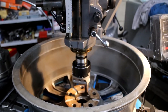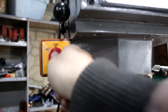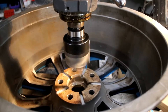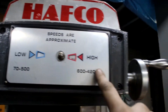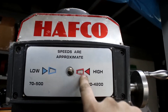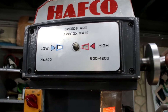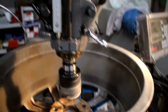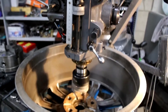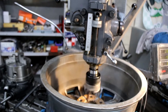Now that we're set up on centre, I'm going to set the speed and feed. Depending on whether we're in high or low gear it changes the direction of rotation, so I'll make sure it's going forwards. Up here I've got two speeds — low and high. We're in high, so we're currently doing 900 RPM. The top of this machine is a CVT gearbox so I can wind the speed up and down — about 800 RPM is probably alright for this. Rather than me pulling the lever to bring it down manually, which isn't very smooth, this machine has power feed.